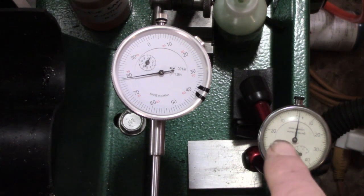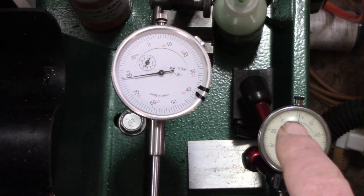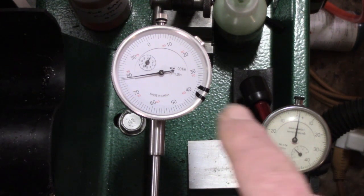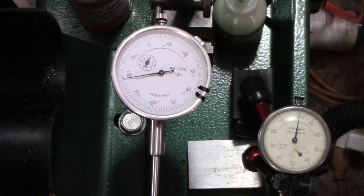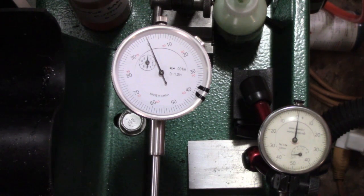And we're actually showing on the inch one - it's actually just under 79. And if you do the math, if you multiply the 200 indications on here times 2.54, you should get 78.8 or something of that sort, nearly 79. That is what we've got. So I'm going to come back the way I came, back to zero. Not 100 thou, just nearly 79.